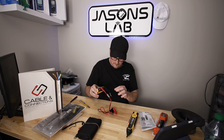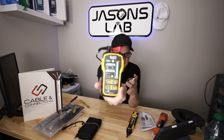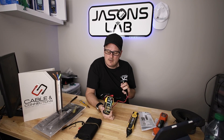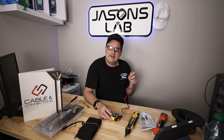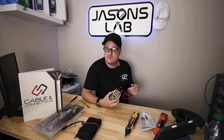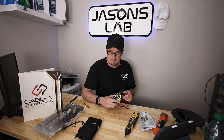You can also use this to find shorts. Clip it onto your cable and if the leads touch there's a red light indicator. So if you have 16/2 speaker wire or alarm cable and a staple was accidentally shot through it, instead of blowing up a 12V or 48V device, you can use this to verify whether you have a short before connecting anything. Very handy.